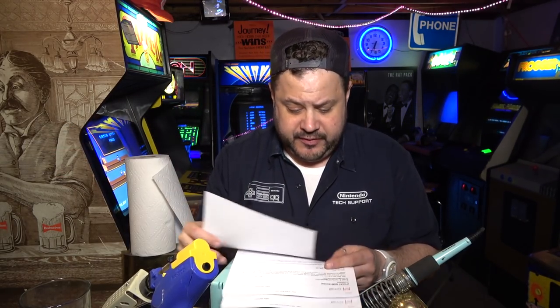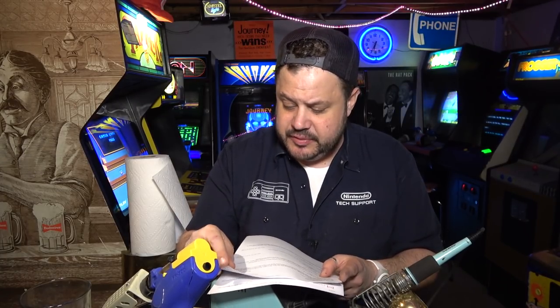And then you download the arcade one for MAME, and you'll have a zip file. Open up that zip file. There's going to be a bunch of ROM files inside there, and those were literally dumped from the arcade hardware at some point. So that's what MAME is. Those MAME ROMs, someone took the EEPROMs off Tapper, put them in a reader, read the data, and then dumped it into MAME by sharing it with the community in a zip file. That's what MAME is. All right, let's save this one for last.